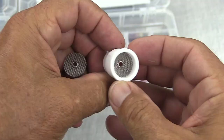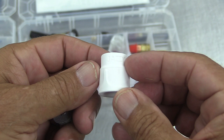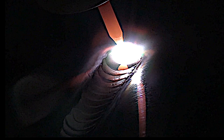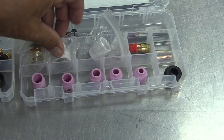The ceramic Jazzy 10 is a DC cup, great for stainless steel, chromoly, carbon steel, tool steel, even some light titanium work. This is some 4130 chromoly and this is the second pass. I'm doing a little pedal pumping here. But another benefit of a cup like this is if you get a really good shielded first pass, the second pass just goes in a whole lot better.